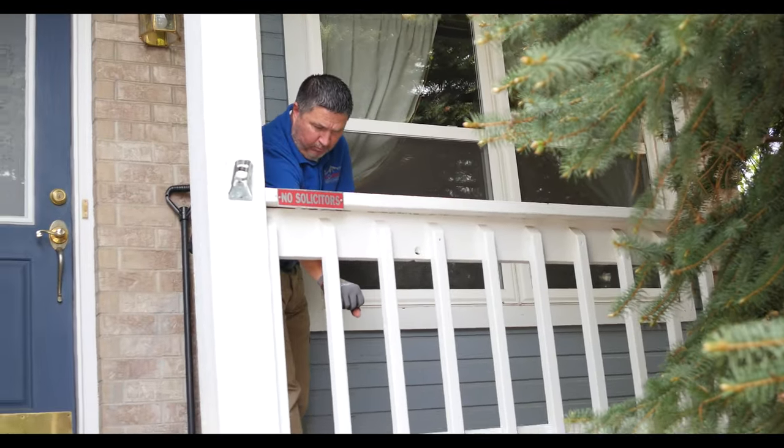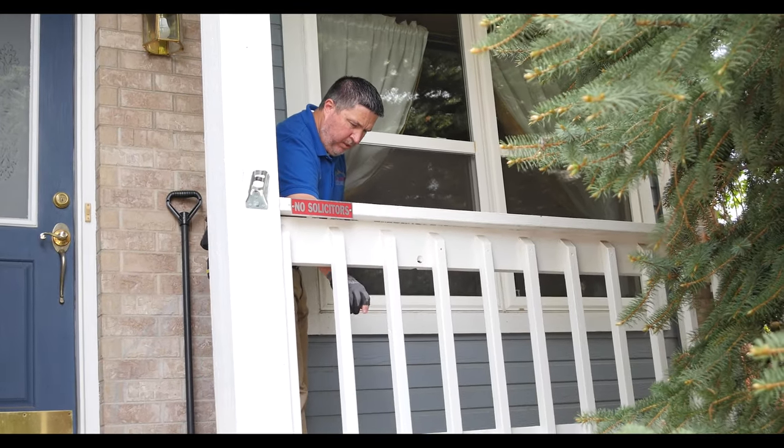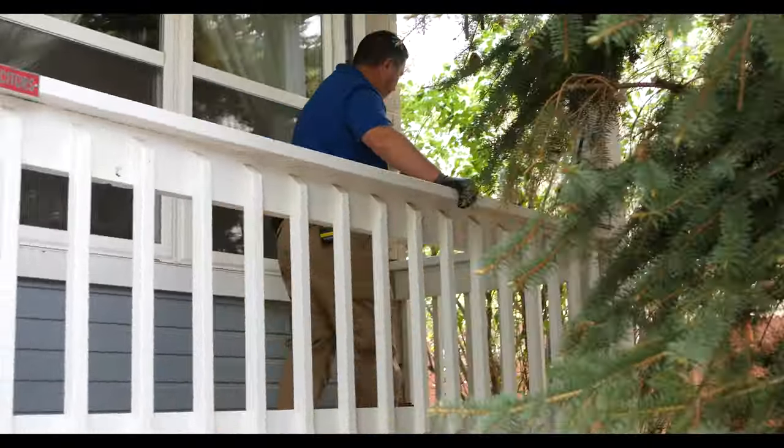A little wider here, but when this home was built they weren't really requiring you to put four inches between the balusters. But of course according to the SOP we need to call that out.